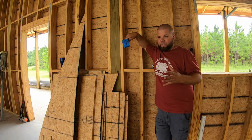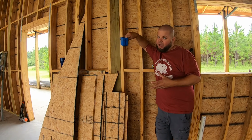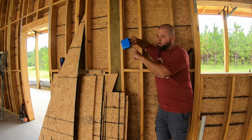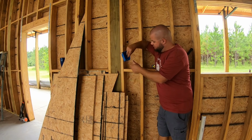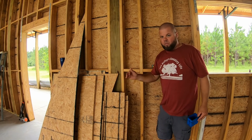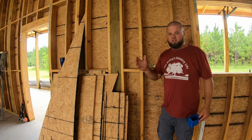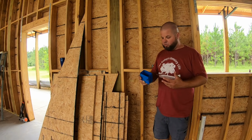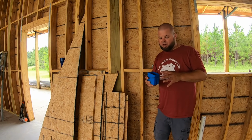So now we're at 40 inches, and I see a lot of people recommend you can run outlets close to that. I'm going to go a little higher, give myself some wiggle room, and do 42 inches to the bottom of the box. I don't want to get too high toward the other cabinets, but I want to give myself enough wiggle room that if we do a slightly larger backsplash, if the countertop's a little thicker, I think 2 extra inches is plenty good right there. But if y'all see anything wrong with this, let me know.